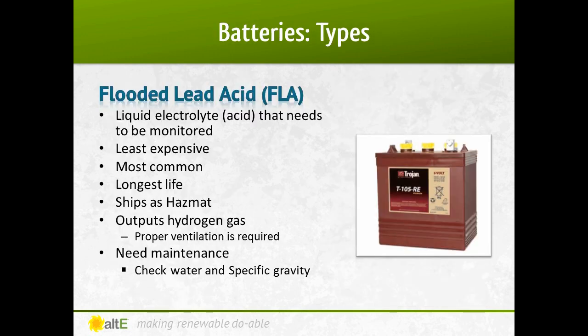When selecting a battery for your system, there are two primary types of deep cycle batteries available: flooded or sealed. A flooded lead acid battery has removable vent caps that you must remove to check the specific gravity of the acid and add water on a regular basis, usually once a month. Because it is not sealed, it is designed to output the hydrogen gas created during its charging process — therefore, the battery bank must be properly vented to the outside. If you are looking to have flooded batteries shipped, be aware that they are considered hazardous material by the Department of Transportation, so additional precautions and expenses may be required. The advantage of flooded batteries is that they are less expensive than a typical sealed battery, and a well-maintained flooded battery will generally last longer than a typical sealed battery. But if you neglect the battery and do not handle the maintenance, you will quickly have a dead battery bank on your hands.